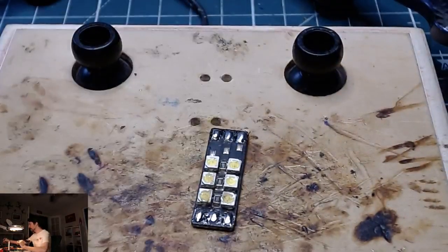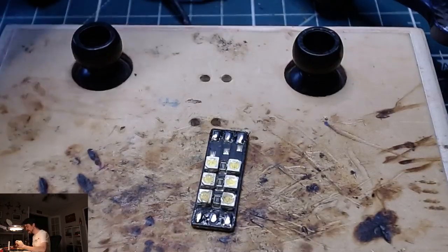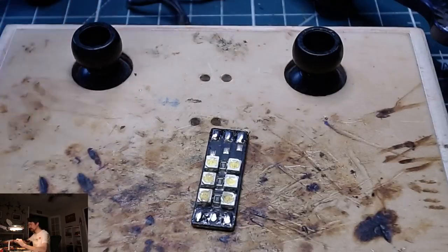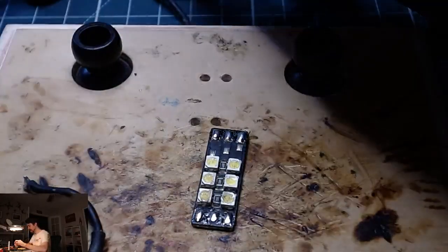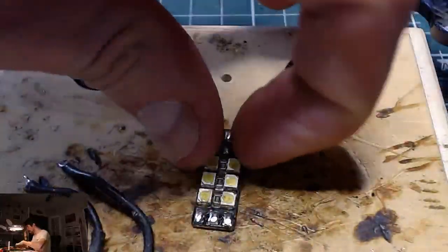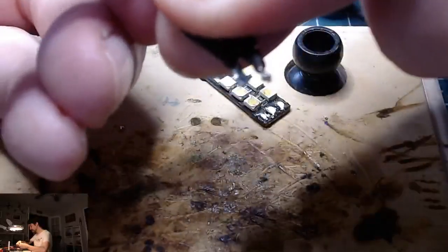And I think you're going to start to see bigger motors coming out. We've already got the Emax 1606, which is an option. Somebody just came out with a 1607. There's an 1804 that exists that I'm actually really interested in. My guess is going to be, though, that you can try dropping the PIDs down, increasing the filtering, stuff like that. But like I said, keep in mind that you could just be running up against a physical limitation, right? It's just physically not able to shed more heat than it already is.